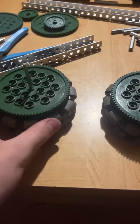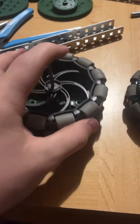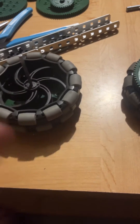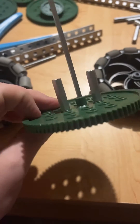I want to teach you guys how to get rid of this play and turn it into this, where there is no play. As you can see here, this is just a gear with a little spacer in there so it doesn't hit the omni wheels — that's how most people do it. Then they put shaft collars on it.